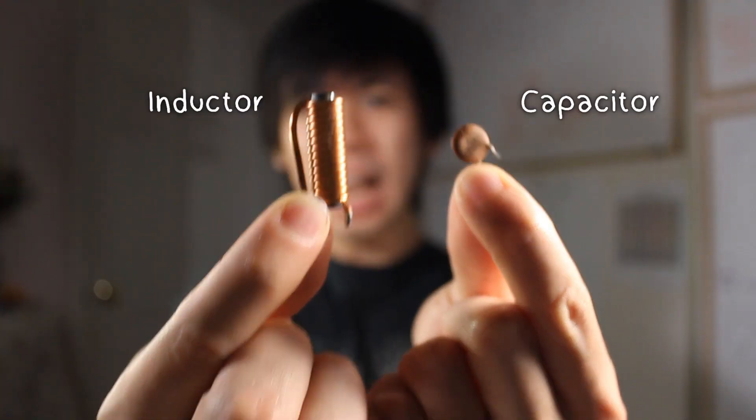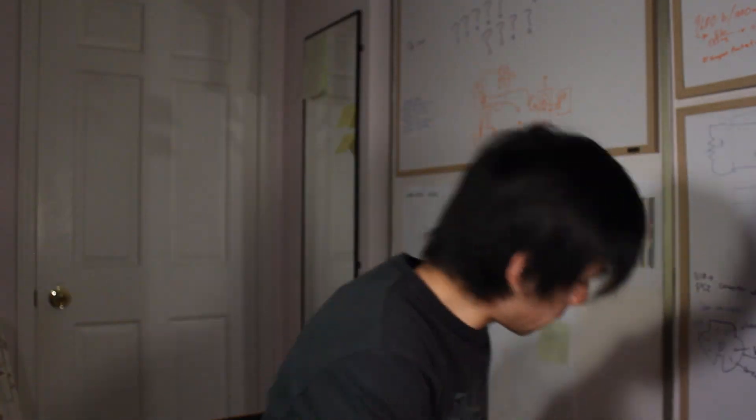Here's how it all works. When you connect a capacitor and an inductor together — an LC circuit — they start charging each other back and forth, creating an oscillating current. If we use a really big coil, we can change the inductance by changing the permeability of the air around it. The change in inductance changes the frequency of oscillation, and this is what happens when metal comes close to it.